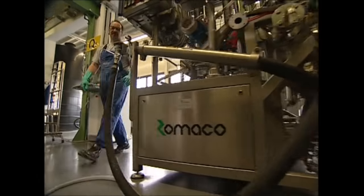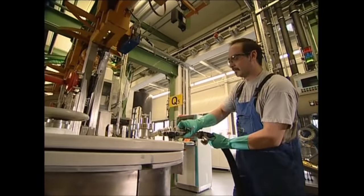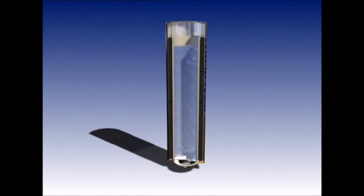Like Yin and Yang, a battery is made up of two opposites — both a positive pole and a negative one. We've got the positive. Now we need to make its opposite by combining zinc powder and a gelling agent. The mix is very toxic, so a machine is used to minimize human contact. The combination creates a gloopy substance which is a negatively charged gel. Once it's fully combined, this is added into the lining in the battery cases.